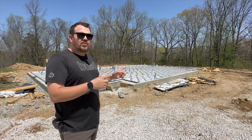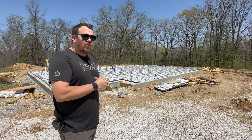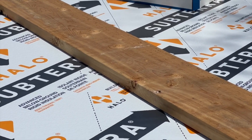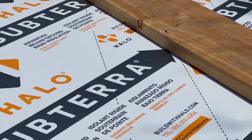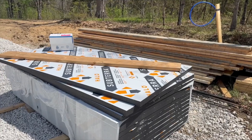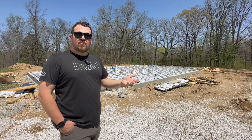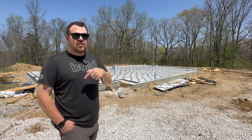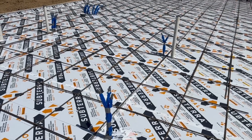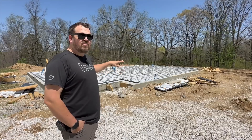What products are we using and why? If you remember from the video on the New Prairie Arrow, we are using a Halo Subterra product. Up there we used Halo InTerra because we're inside the building. Here we're in ground contact, so we need Subterra — as in subterrain. This is GPS, graphite polystyrene. It's a little better for the environment than XPS — the blowing agent degrades the environment less and it maintains its R-value longer, so we have less R-value degradation. It also has more than the compressive strength we need to support this slab, and it is approved for below-grade use.